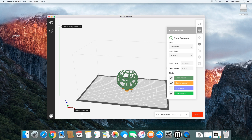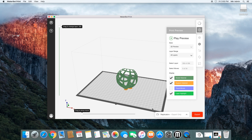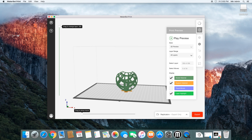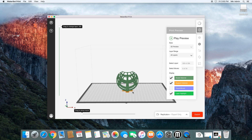What you can see at the bottom — this orange thing is our raft material. Before printing any of the model, what the printer will do is create a raft at the base of the model to help it adhere to the build plate and keep it from moving around as it builds upwards. This is recommended for all models that you print. It is the default setting and we recommend not changing it, mostly because in our experience we've had bad luck whenever we take that off — it really helps it adhere to the bed.